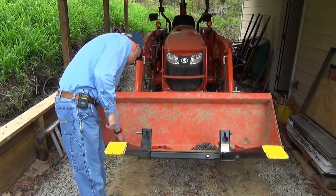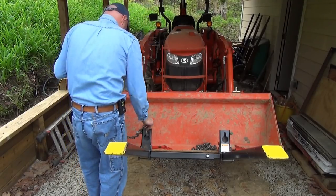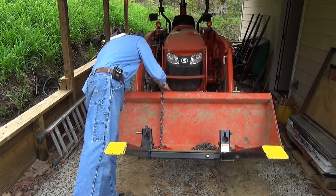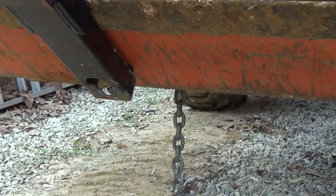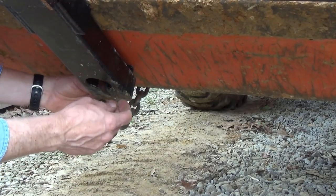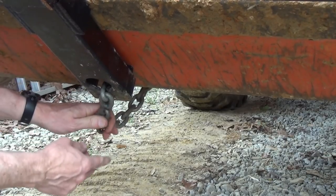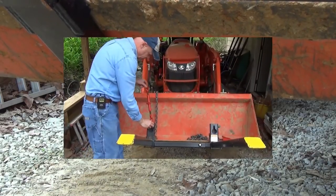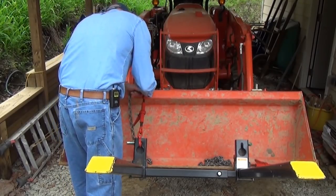Most clamp-on pallet forks are designed to allow the use of chains or straps to go around the bucket for extra support. I use two short sections of towing chain and load binders to protect my bucket lip from bending under heavy loads. It is important to make sure your straps or chains go around just the bucket and no other parts of the front-end loader. These pallet forks have a keyhole cut in the bottom to accept a hook or chain link; other designs may have a hoop or heavy eyelet to hook to. I just hook a chain link in the eyelet, pull it snug, then take a load binder and hook it into the eyelet on the top of the pallet fork and hook the other end onto the chain.